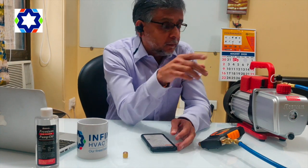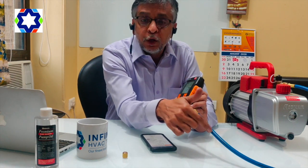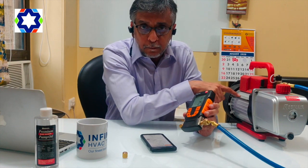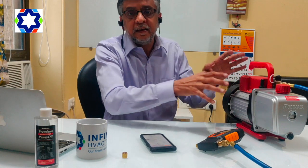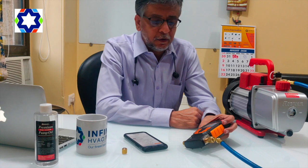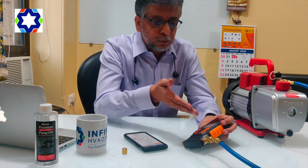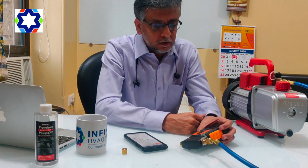You confirm that your digital vacuum gauge is okay, your vacuum hose is okay, and your vacuum pump is okay. Once you confirm these three points, only then install everything on your VRV system. This will ensure that these three things are fine and you won't waste crucial hours on site. You can buy all these products at our website — the link is given in the description. Thank you, see you soon, stay safe.